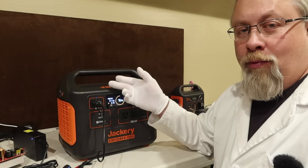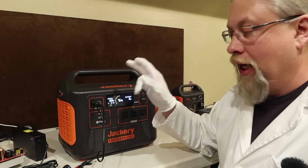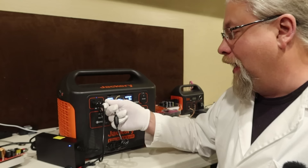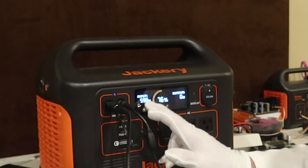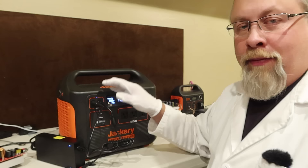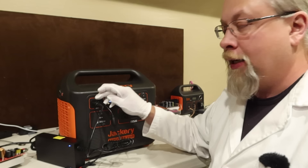So you can put 300 watts from any source on one side and 300 watts from any source on the other — one could be 12-volt from your car, solar, or the wall charger, the voltages don't matter. I could hear a click when connecting each input — that tells me there's a relay on each input. It sounds like they have two completely separate MPPT controllers in this. That's super cool.